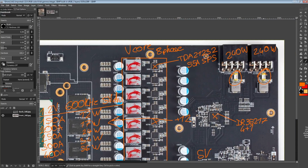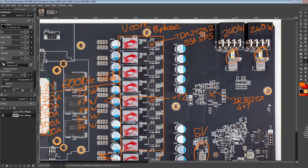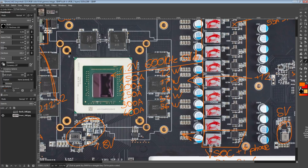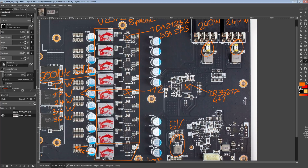So the whole point of these fuses is basically to blow up before the output voltage rises too high and to prevent power cycles. Because if you have a GPU where the power stage has blown up and then you power cycle it over and over again, every time you power cycle it, the output of the VRM will go to a very high voltage for however long it takes your power supply to trip the overcurrent protection, or short circuit protection. So basically the fuse isn't here to prevent physical failure of the card, it's to prevent further damage after the physical failure has already occurred.